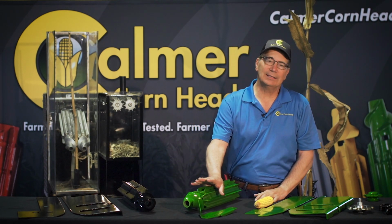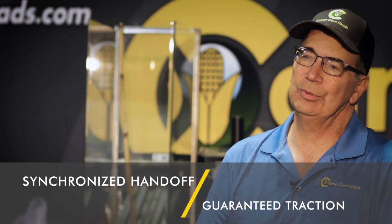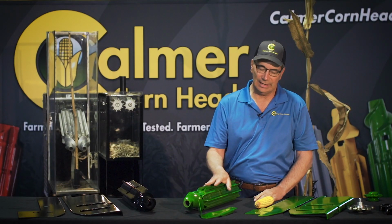That goes back to the design of our stalk rolls. With that revolving window, 100% traction, we don't have to pull that stalk down nearly as fast as I used to with the older style. So that helps. We're able to slow our heads down. They're going to last a little bit longer, and we're going to have less trash intake. So all of those are on the mechanical side of things.